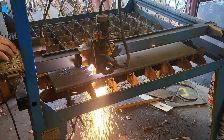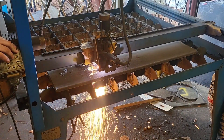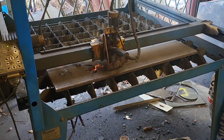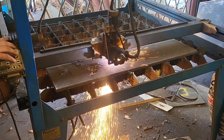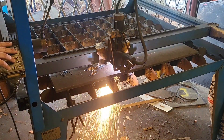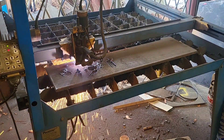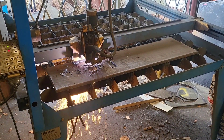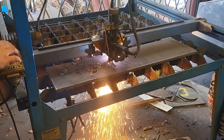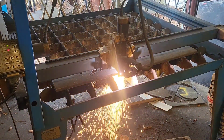This is three-quarters inch, so it takes a little longer to cut than thinner materials. It's not the max this machine can do, but at this thickness it really doesn't want to cut cleanly — you get more of a curve to the cut edge and it's tough to get a good finish. It doesn't help that this bed hasn't been changed out in years, so the plate doesn't sit exactly flat. Ultimately you want the plate as flat and parallel to the cutting head as possible for a clean finish.